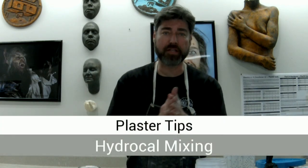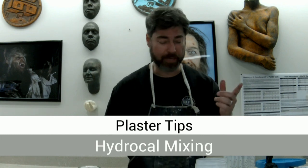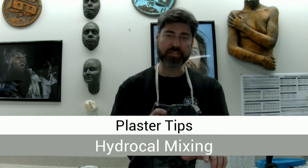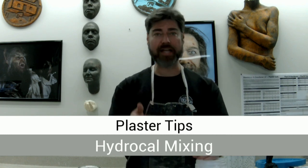It's time for another tutorial. This is a tutorial that will be quick and to the point, but this is something I get a lot of questions about. This video will focus just on the mixing of HydroCal. It's real important to know that HydroCal is part of the plaster family — it is the highest end of the plaster family in strength. In the plaster category, we have all the way down at the bottom plaster of Paris, then gradually going upwards through number one molding, number one casting plaster, all the way up to HydroCal, which is the strongest of the plasters.